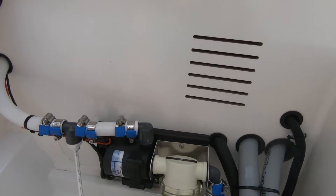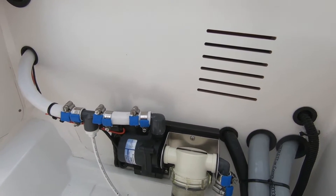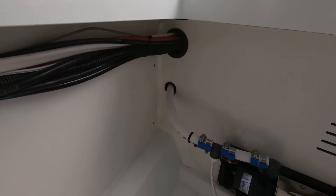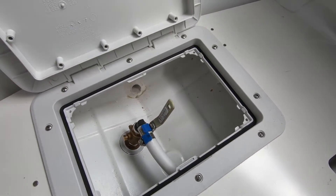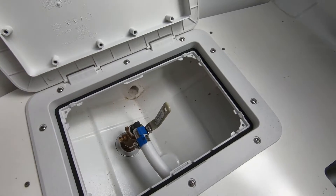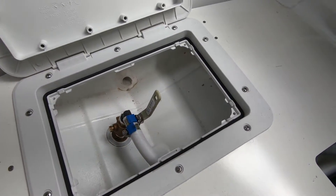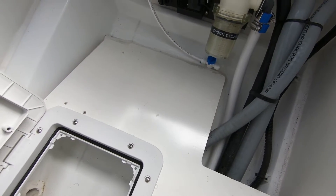We leave this loose so you can go into a cup — you don't have to go straight into the bilge, although you can just put it in the bilge right over there. If we look down, this is where the through-hull is located. We have the through-hull coming in, our valve, hose going to the strainer, and then the continuation over there.